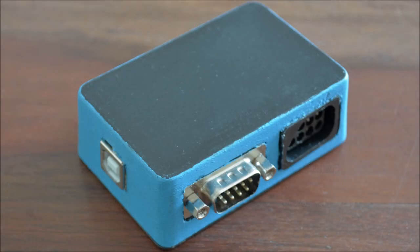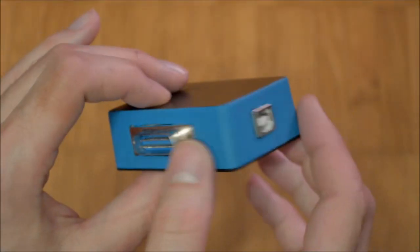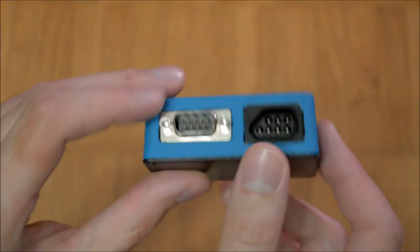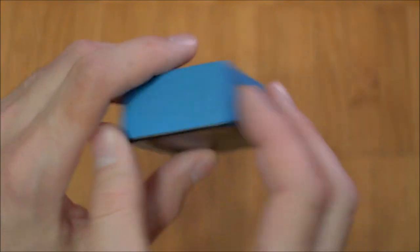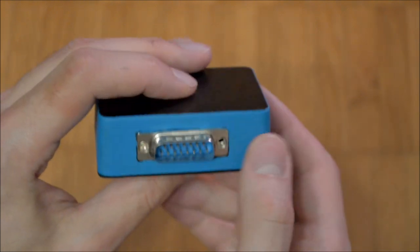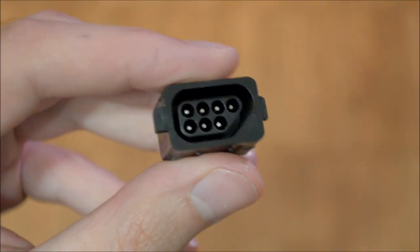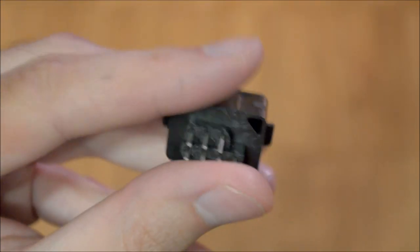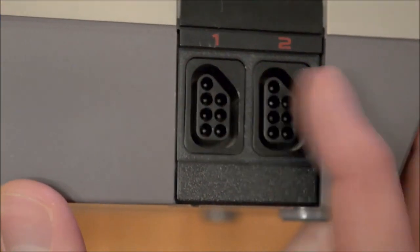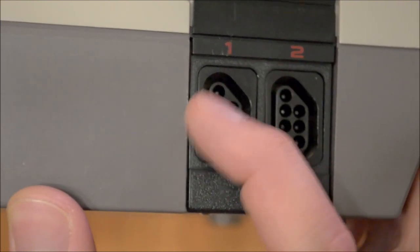I went with the ATtiny and put it into a generic soapbox into which I made recesses for NES, DE9, and DE15 sockets. This allows me full NES, Famiclone, and Famicom compatibility. Of note is the terrible quality of third-party NES controller sockets. Using those, I struggled with bad connection quality during the roll video. If for some reason good quality sockets must be used, I guess there is nothing left but to scavenge original consoles.